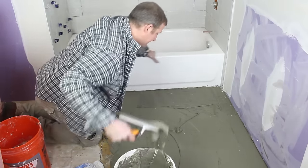With the right notch trowel using their DITRA trowel, you can walk on this afterwards — it won't indent. Sometimes if you kneel on it a little bit it can in some areas, but if you're using the right notch trowel it's not going to sink too much. If your floor is pretty level, it's meant to be able to be walked on immediately afterwards. Also, you might be wondering what Steve is doing here — he's pounding in any loose ring shank nails, always a good idea to do that.